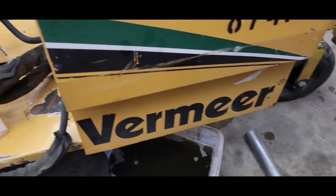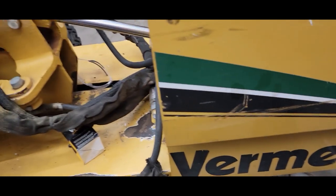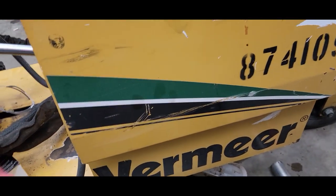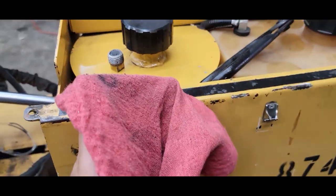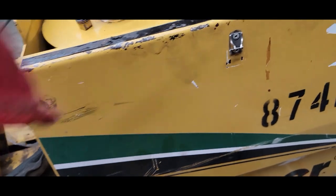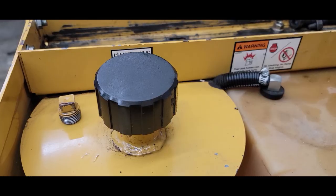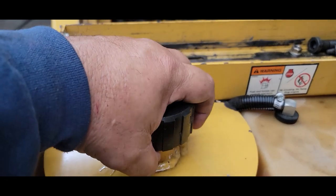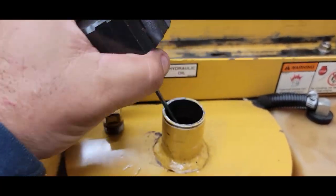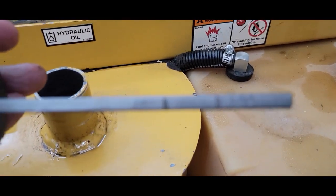Whenever you're doing anything around hydraulics, clean anything around, clean your bucket, clean everything that you're going to be pouring the fresh fluid in. You don't want to get any dirt in the hydraulic system. So you're doing it like in a sterile environment. And then you're going to say, well, how much do I put in, Adam? Looking at the 252, this doesn't unscrew off, it pulls off. And it even says, and let's see if we can get this to focus.